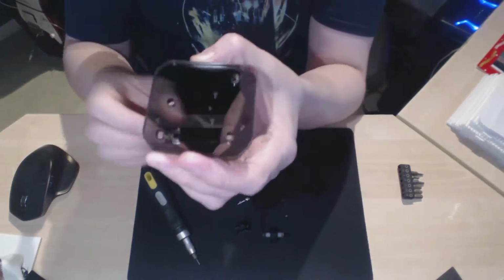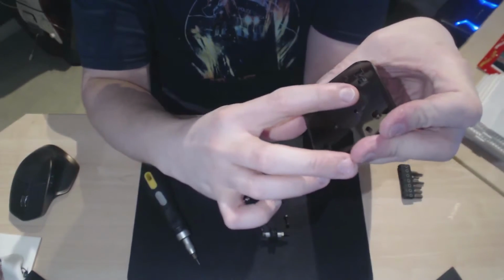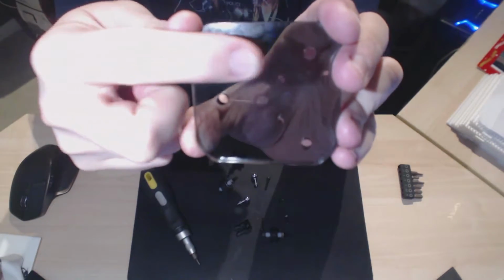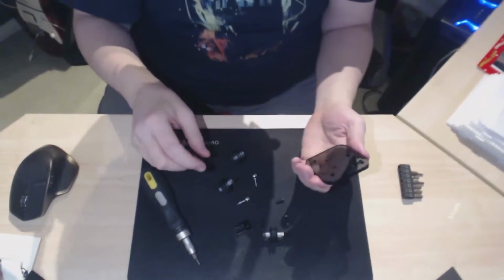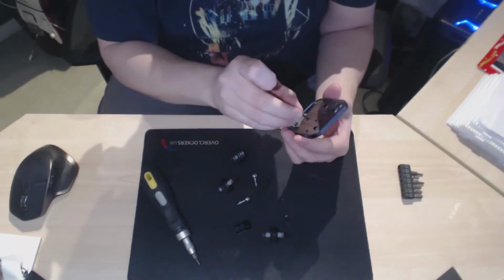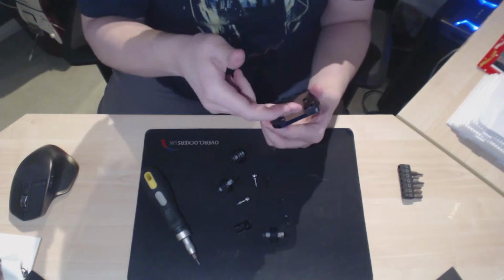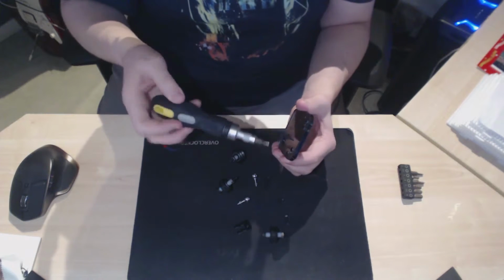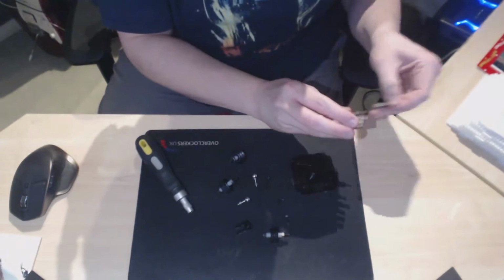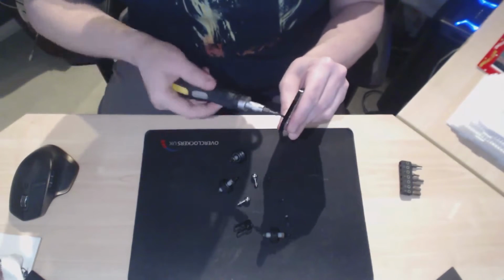So first of all, you start with the new carriage holder, and on that there's an M engraved, which you probably see. Yeah, you can just about see the M just there. You want the engraved bit facing you, and then you take one of the longer Allen bolts and you thread that through the hole like so, with the engraved M facing you. You then install that into here. Switch that out to get the right size. Okay, so we do that, and you just drive that all the way in.